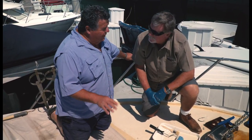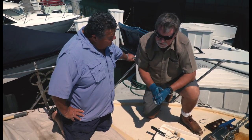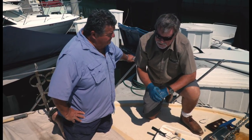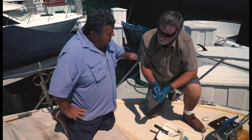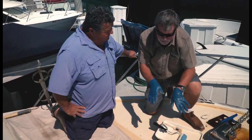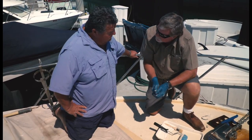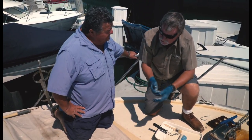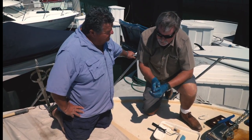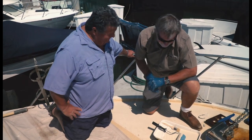This isn't like the old way where you would put paint and then throw sand and cut your feet walking on it. This is all rubberized paint. It is a one-part mix and we like to do two coats. It is rubber so it's cooler, better on your feet, and cleans up really nicely on a boat deck. It can be used on fiberglass like this application or on an aluminum boat with a different primer, our MP on bare metal. It's a great product and it's going to look real nice.